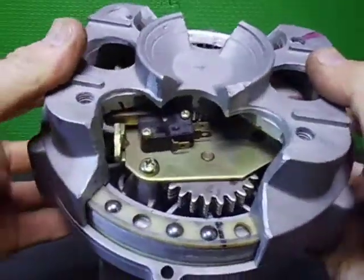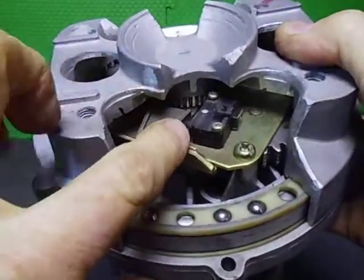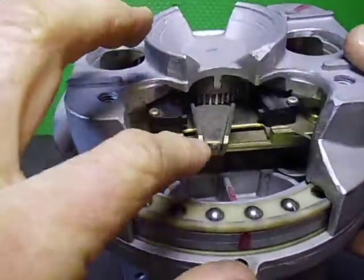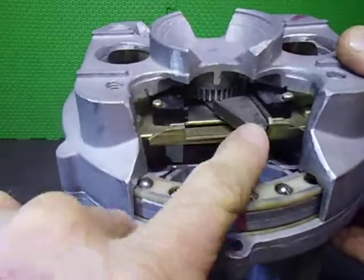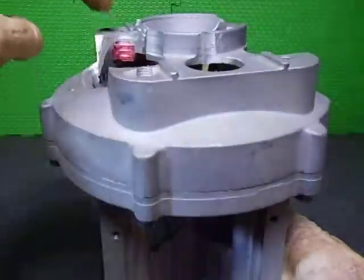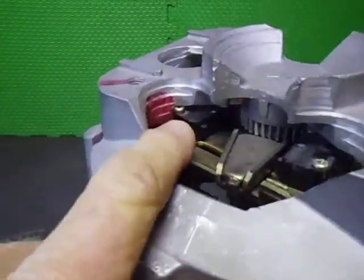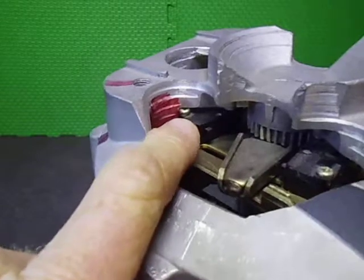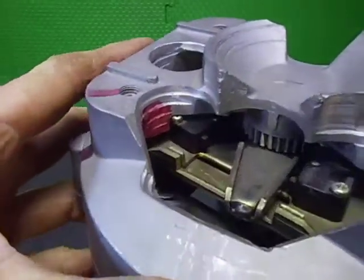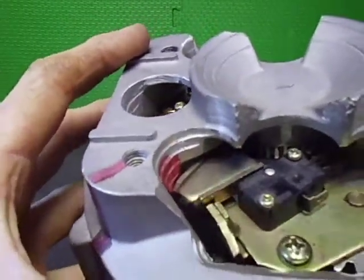You have the limit switches up in here. There's the knock bar for the limit, and in the very back you can just see the potentiometer drive gear. There are your two limit switches and the end stops for the knock bar. The knock bar — where this red bit is — will come around and hit, turning the limit switch off. The tolerances are really, really close, so if you change limit switches, make sure you put everything back exactly as you had it. Putting a washer underneath, for example, would cause it to hit the casing.